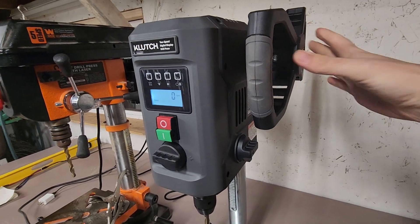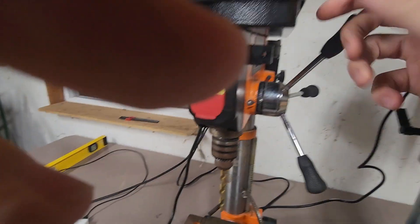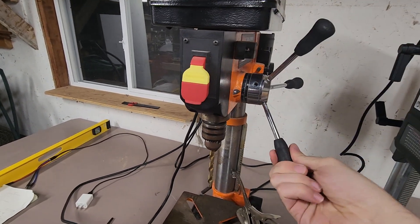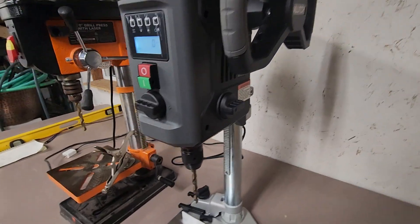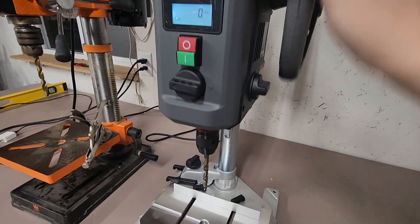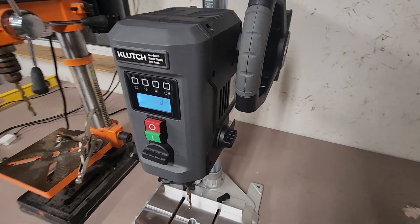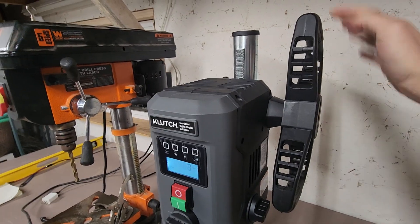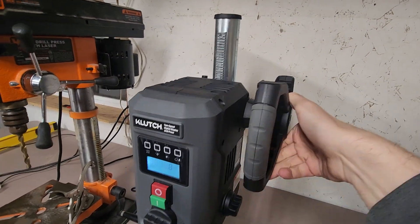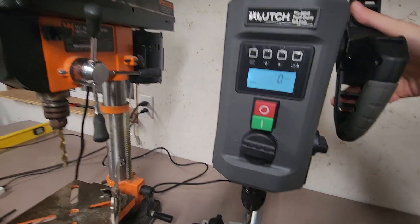The thing I dislike most about the Clutch is probably the handle. It only has two arms versus the standard three on the WEN. With three, I could grab the front one for a shallow drill or the bottom one and go all the way around, and they were always in the same place. A downside of the motor unit moving up and down is that it indexes on the track, so depending where you set the body the handle is in a different position every time — instead of always being in front where I could grab it blindfolded, I have to hunt for it. With only two arms, hand-over-hand operation is also more awkward.